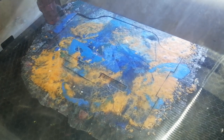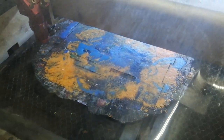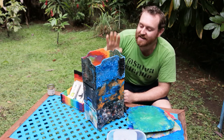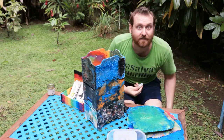We set the laser cutter to take anything being cut through and cut it 10 times instead of one slow pass — it just goes pew pew pew. Each one of these panels took about five to ten minutes to cut out.